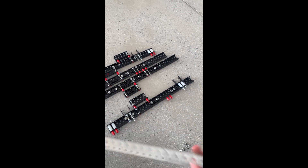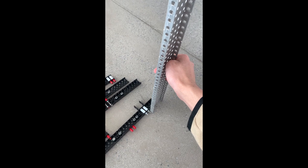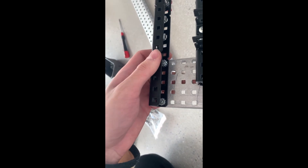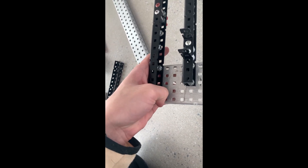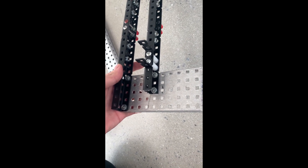Basically, you'll want to grab a full-length 5-wide C channel and just screw it on at the end with shoulder screws. I'll skip through to when I'm finished. Here's what it looks like after it's done — every one of these screws is mounted with shoulder screws and they're all aligned. Preferably you want screws on either end, but my drive is not the same length so I just stick with this.